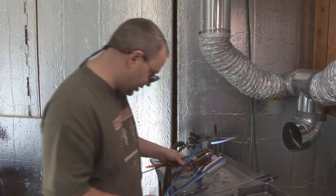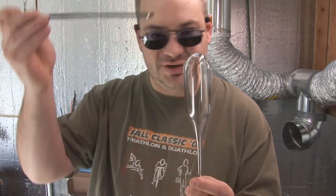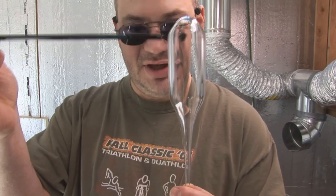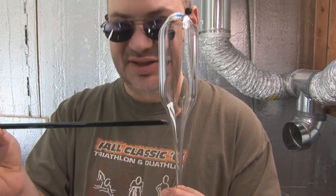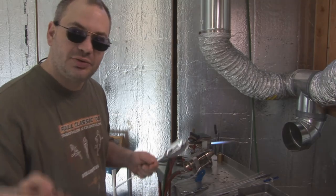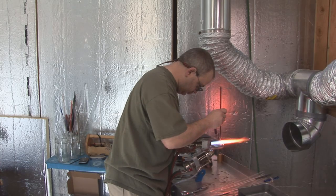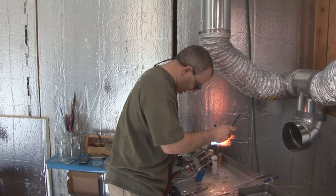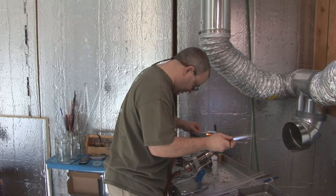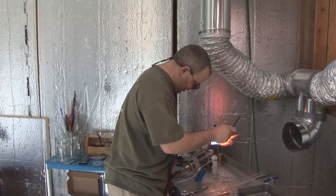As always when doing the color tube, you have to choose your colors. I've got myself set up here for what I think is going to be a beautiful tube and I'm going to go ahead and commence. Now the first trick is drawing lines — from here to here, avoiding this section and this section of the cone where all of the direction is going to change. It lets me get a more uniform color tube. If you worry about every last cent of glass, you're going to have to push a little harder. At this stage my only real goal is to get nice even lines that run axially along the outside of the tube.